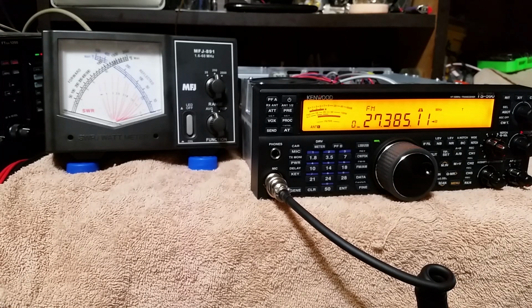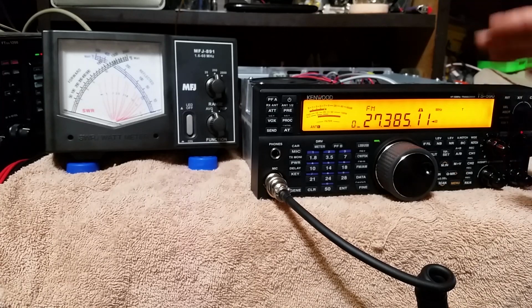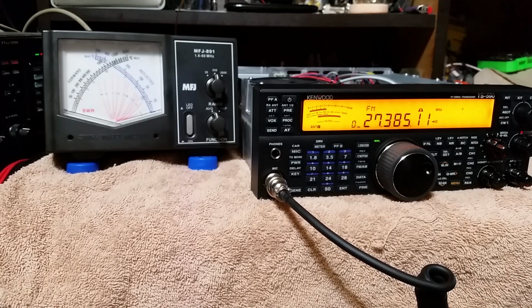So what we're going to try to do is, at first I'm going to shut ALC off. You know, this disable ALC. That should get me safely right around probably 100, probably 135, 140 watts on this radio. You know, it's got the RD100HHF finals in it, so it's not going to be coming close to even maxing them out. But that's not what I'm looking for. I'm just looking to see if I can take control of the ALC, you know, physically, without doing software hacks or getting into the service menu and screwing that up.